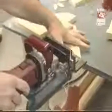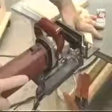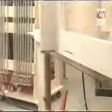Now these are the plywood braces, and I'm making a slot for a biscuit to attach it to the frame. And that's the corresponding slot. All right, I'm going to start with a couple more filler blocks. All right, now a biscuit in the slot. Slip that into place and tack it.